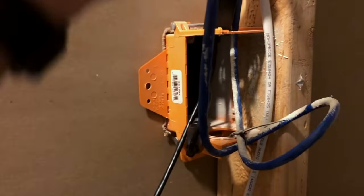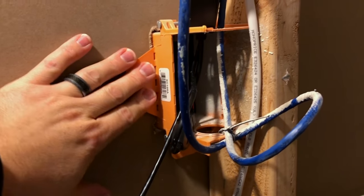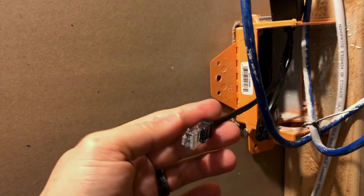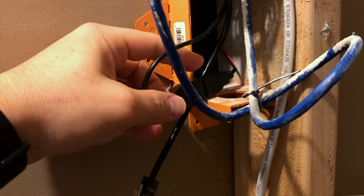He added the recessed outlet right above another outlet, so it was easy to wire up, and electricians can usually do this quickly and inexpensively. Downstairs, he was able to add a low-voltage box before finishing drywall. It has Cat 6 connected to a Power over Ethernet switch on one end, and on the other it's a PoE splitter to data and USB. He connects his tablet to the USB for power, which is pretty cool.